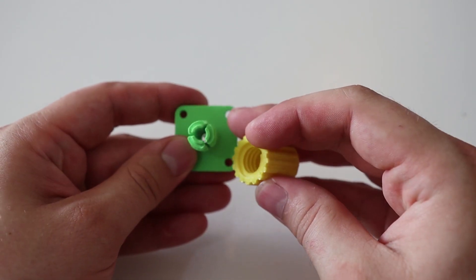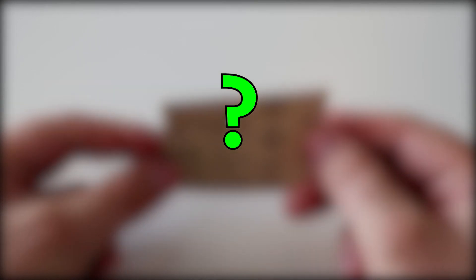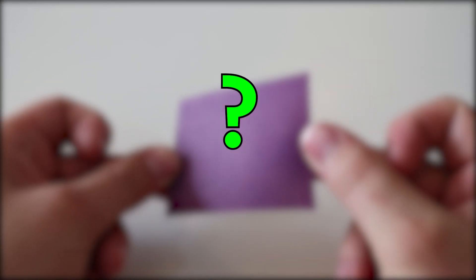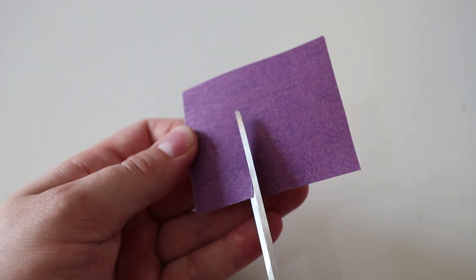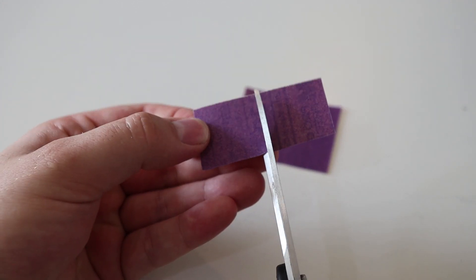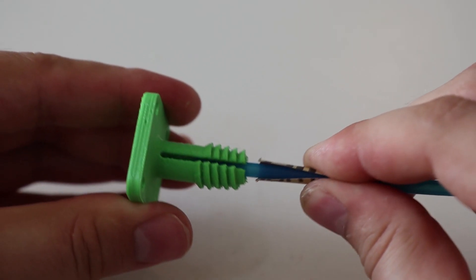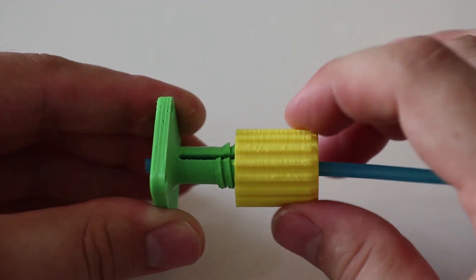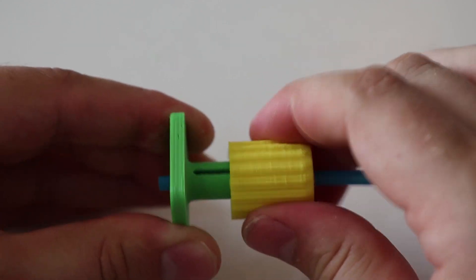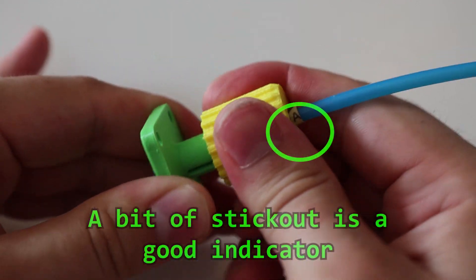I'll now show you the secret ingredient you need to get an absolutely good grip on the bowden tube — something they probably didn't do in the old design from years ago. You might be screaming 'rubber!' but actually no, it's sandpaper. You need to cut off a little section of sandpaper so it just wraps around the bowden tube with the length of the 3D printed part. Then with a bit of twisting and pushing you can insert the bowden tube and sandpaper sandwich into the 3D printed taper. Carefully twist on the nut while keeping track that the sandpaper is still in the correct position, then keep tightening until everything is tight and nothing is moving anymore.